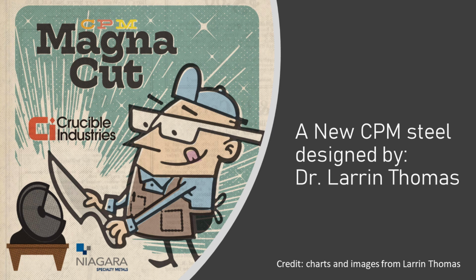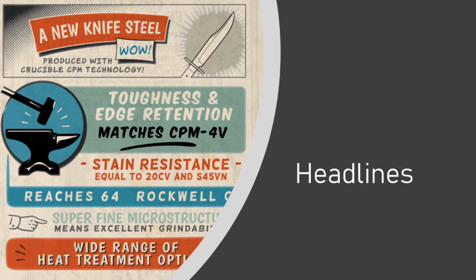I have a sheet of it on the way for myself. I'm by no means the ultimate authority on these things, but I just want to highlight some of the high points of the steel for you. So here are the headlines, and we'll dig into these a little bit. Toughness and edge retention that matches CPM 4V. That's good. Stain resistance equal to 20CV and S45VN. Good. Those are sort of top stainless steels until you get into the LC200s and Vanax of the world. Reaches 64 Rockwell. That's pretty high. Fine microstructure. So we're going to take a look at all these things. A wide range of heat treatment options would also be of interest to knife makers.